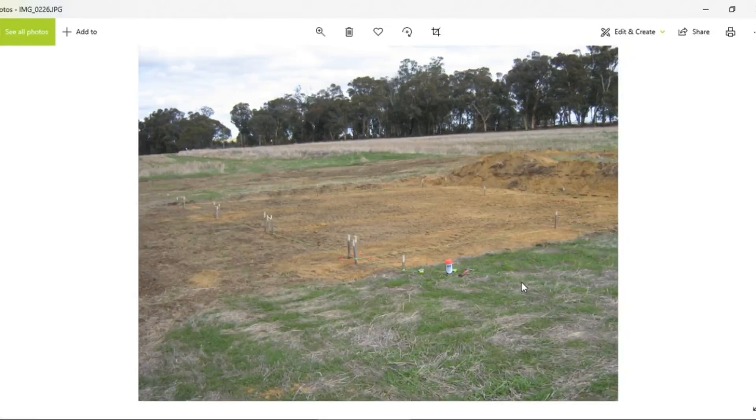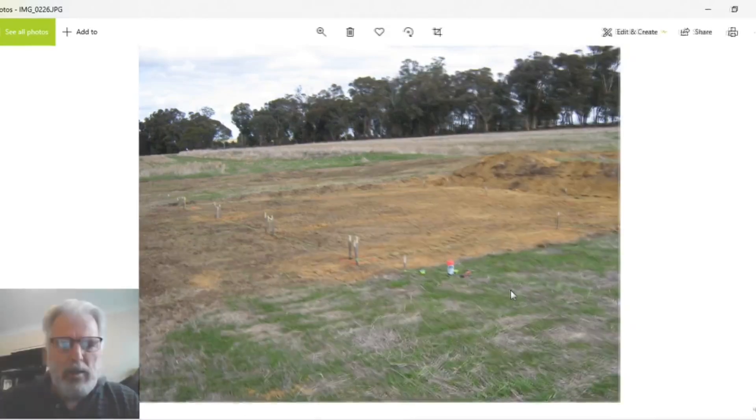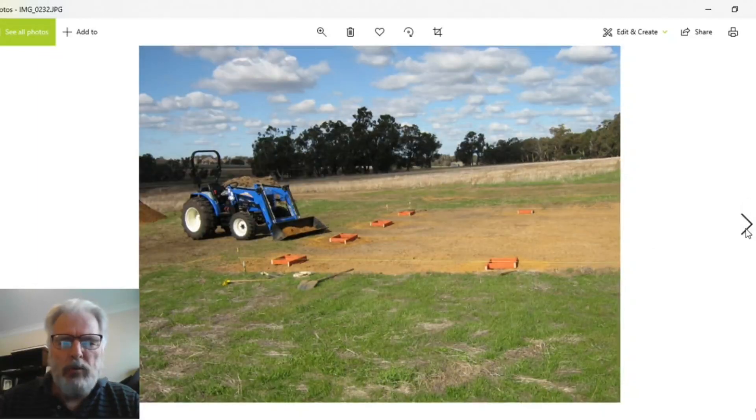When we started off it was a straight cut — no cut and fill. I didn't want to have to be compacting anything. With the machine shed I could either build a pad and bolt straight onto that, or I could put stumps in the ground. I had a post hole digger so I went with stumps. I decided to raise the stumps up a little out of the ground so if I ever put a concrete pad in I'd have a hundred millimeters to work with. We put some little boxes in there to make a round hole into a square top, and lined up all the strings to get the outside of the concrete level with the outside frame of the building.